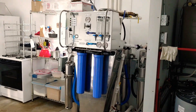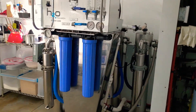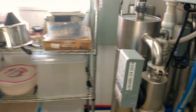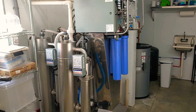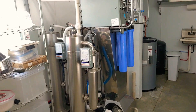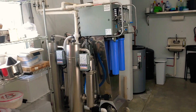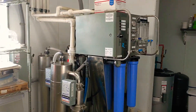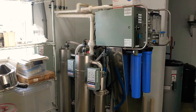This is really what does most of the work. This machine has four membranes — four eight-inch membranes — inside those four stainless steel vessels behind the machine. Under high pressure, sugar and water are separated; we capture the sugar and reject the water out into that tank outside. We concentrate up to about 16 to 18 percent, and it makes really great syrup.